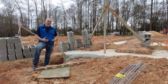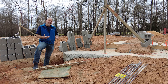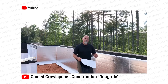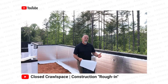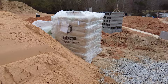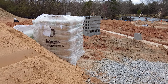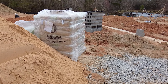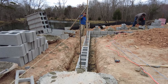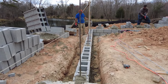If we were going to try to make this a crawl space, we'd have to excavate all that dirt out and then we'd have the expense of building the foundation wall up high and then encapsulating the crawl space. You've seen our videos on crawl space encapsulation — fantastic foundation but it's pretty expensive. On our stem wall slabs, when we have some grade change, we actually might have to lay a block wall up. In this case we're going to lay a block wall up about eight courses of block, which is a little over five feet on the lower corner of this foundation.